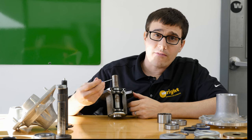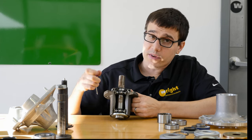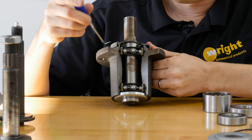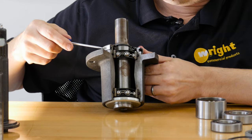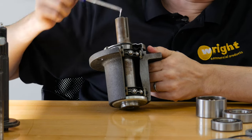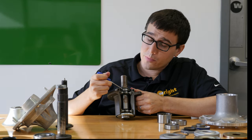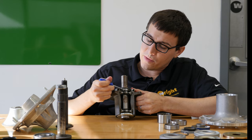On the top, you have gravity working against you, so most spindles nowadays have some form of a top cap. What we have here is a top cap that closely fits the housing. If water goes into the crack, it will go through this groove and pour out the other side before climbing up against the seal. There's an upper seal here — this is actually a dual-chamber spindle, and we put grease in the upper chamber to keep contamination from getting to the bearing.